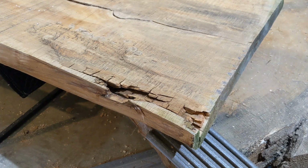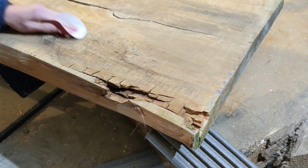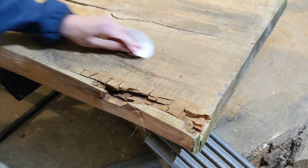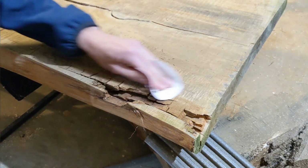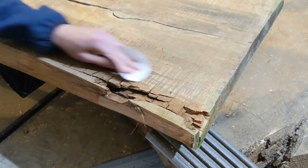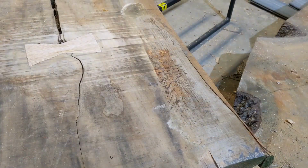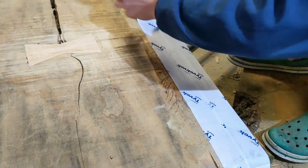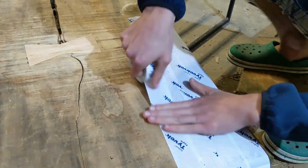This corner of the slab was rotted and punky. Similar to my relationships, it was very dry and had potential to crumble completely at any moment. The best way I knew how to fix this was to use some penetrating epoxy. As I understand it, penetrating epoxy is a very liquidy epoxy that has an extremely long cure time, meaning that even after you mix it up, it stays in liquid form for an abnormal amount of time. This gives it time to seep into punky wood like this before hardening to stabilize the wood.